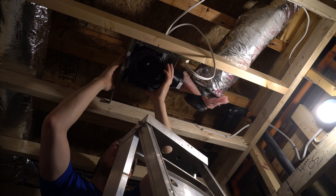Next, let's take this metal plate off right here so we can do the electrical. As you can see, you have three wires here and we have a ground right here to the box. If you have your Romex, right down the center of the wire — that's where your ground is and that's where you want to make your cut, because there's no jacket on the ground. Let's make some sense of these wires.